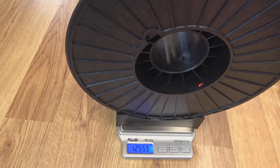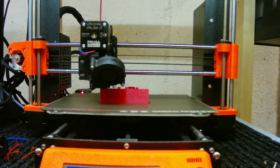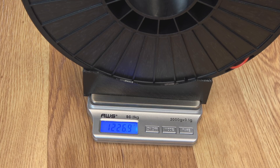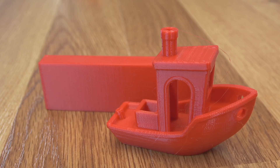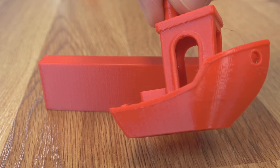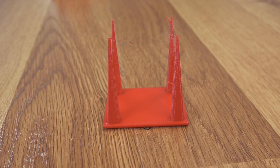This is what I'm going to call the final day — day 50. From the last measurement to this one, we're exactly the same: 1,255.9 grams. After all the test prints, our final weight is 1,226.9 grams. The test print from day 50 still looks really good with just a little bit of stringing. The flat print is almost identical to earlier ones. I also did a retraction test to see what it'd turn out like after 50 days of sitting out — it's a little bit stringy, but maybe not much out of scope for PETG.